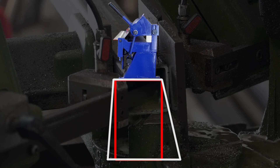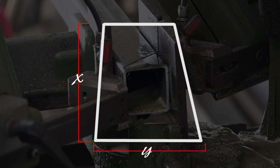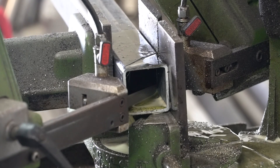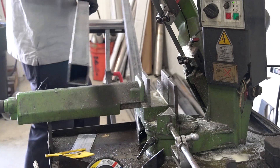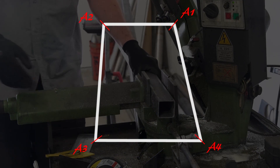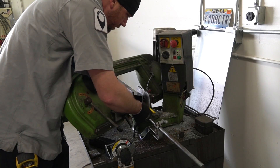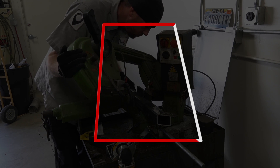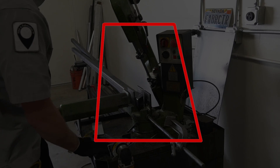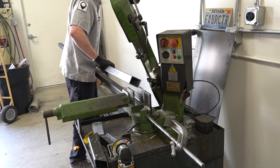On the front side, I don't necessarily want it straight and square either, just in case we have a heavy piece of metal. So we want a design that makes it difficult for the sheet metal brake to topple over — it weighs quite a bit, so we definitely don't want that to happen. This is the design I came up with. It doesn't necessarily matter what size everything is; all you need to know is how tall you want it, where you want it to sit, and the width. We have to make two end pieces, and to avoid wasting time cutting them one by one, we'll cut both sides at the exact same time. Since every angle is divided by two, I'm going to cut them counter-clockwise, and the angle that stays on the saw will be the start of the next tube — meaning I only have to adjust the saw four times to get all our angles to line up.